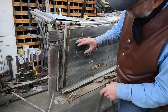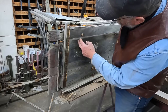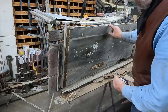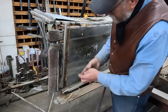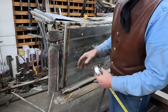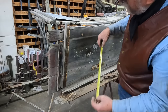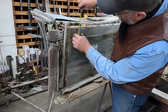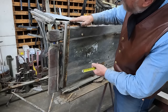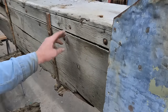Well, as I look at the sides of this wagon, this is the original sideboard, and this top, maybe 3 inches or so, looks to be like it was added on to extend it, which would make sense. This bottom board is about 16 inches, and oftentimes these sideboards for sheep wagons are that 19-20 inch area. So 16 and another 3, plus a little shim here to accommodate for the irons, at the top of this seat bench here would make this sideboard 20 inches. And this other side is done the same way as well.